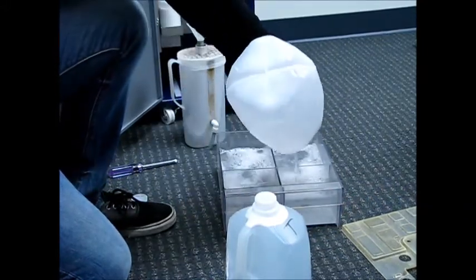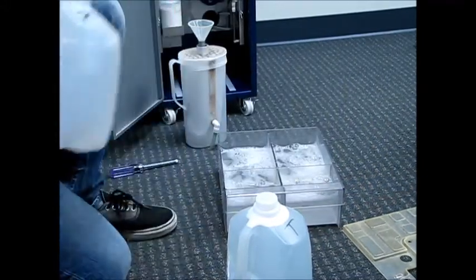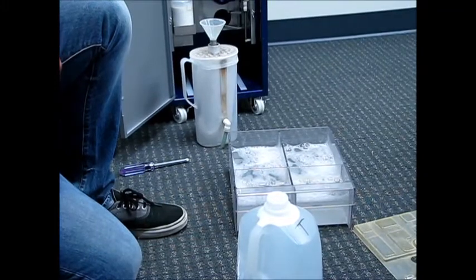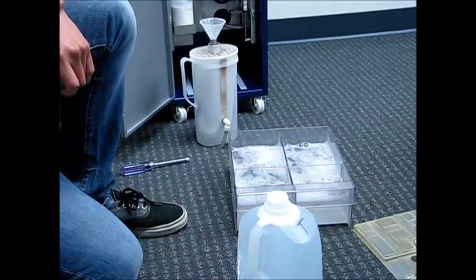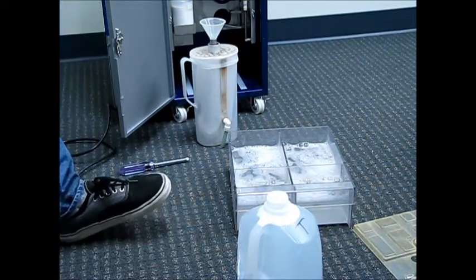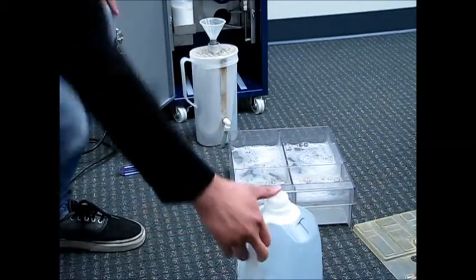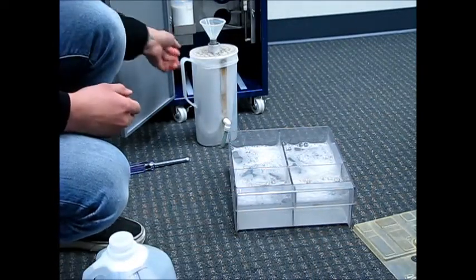The tank is divided into 4 sections, but each wall has a hole, so the water will equalize. So now, if you take a look at the right front corner of the main tank, you'll see that there is a white sticker that says limit or lower limit with an arrow. That's like the bottom of your dipstick. In other words, the level of the water should never be below that.